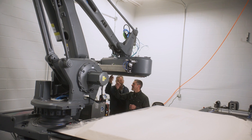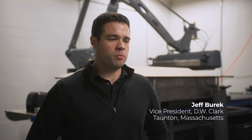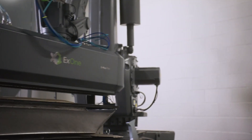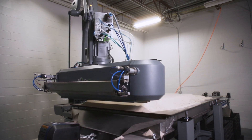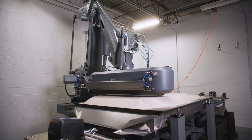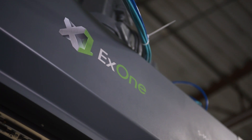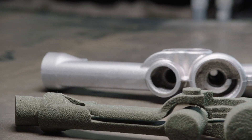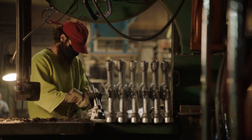Having this machine has shown us a different future in our business. We're able to produce higher-quality parts, parts that have more value added to them, more complex castings for advanced applications, and bringing in technology like 3D printing really augments what our team members can do. There is a distinct cost advantage to producing the core this way over traditional methods. It cuts a tremendous amount out of the lead time, and there's also the cost of that tooling that is simply eliminated.